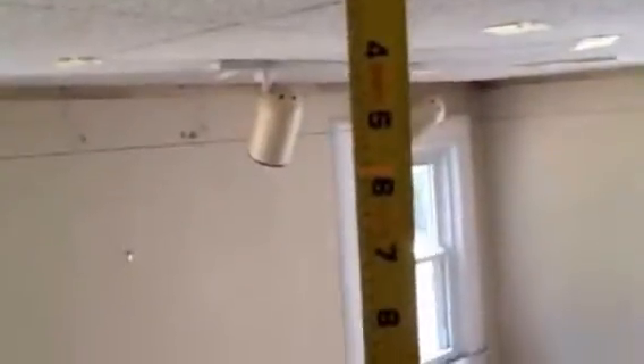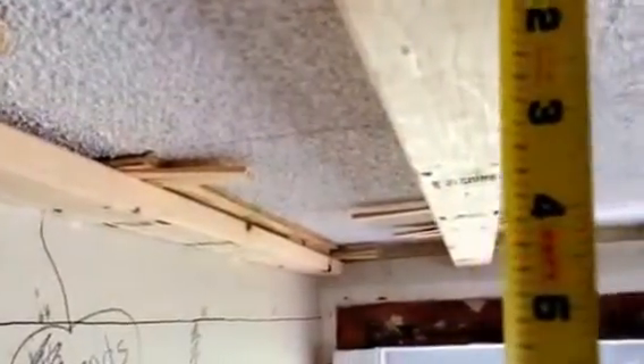Once you get that all gridded up you'll see all my little sticky notes. I measure down with my laser, which is over here, and I beam that laser across the room and get up onto my ladder. I get my measuring tape and measure where that beam hits. My magic number — you can see it — is 4 and a quarter inches. That's where I want all my studs to hit across the room, nice and level. My lowest point was 4 and 3/4 inches.